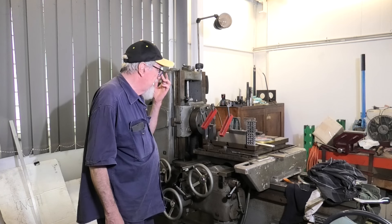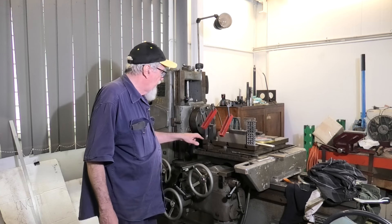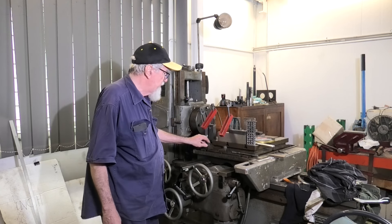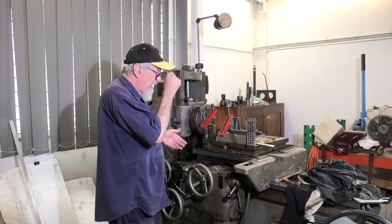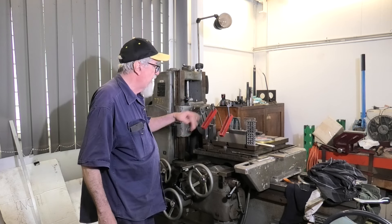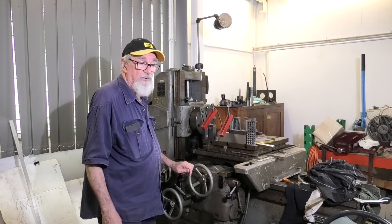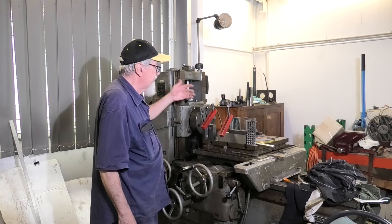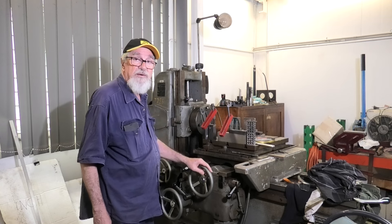This model is fitted with a square rotating table up on the top. It's got dogs that lock the table in. The dogs go into a feed slot so you spin the table 90 degrees or 180, lock it in with the dogs and you are spot on. Very, very good system for boring the gearbox from one side, spin it around, come in from the other side and you're in exactly the right place.